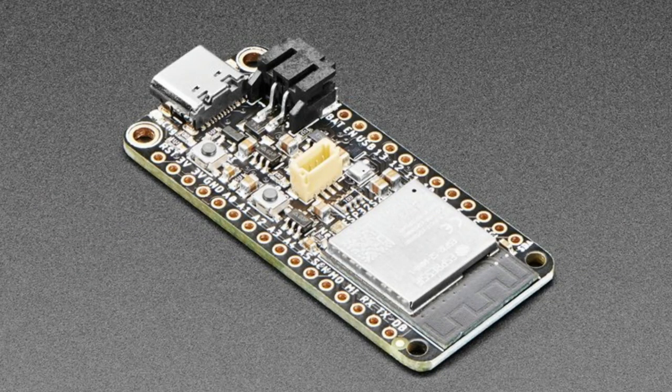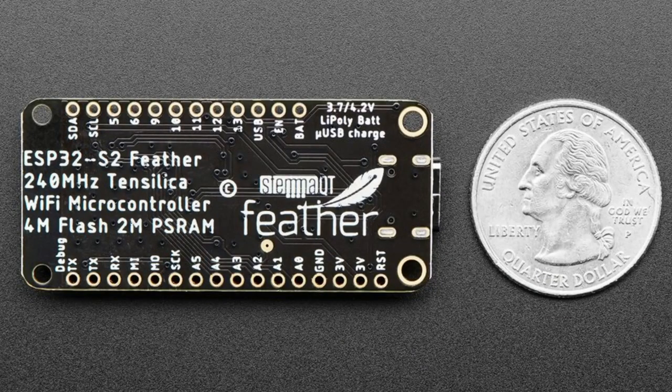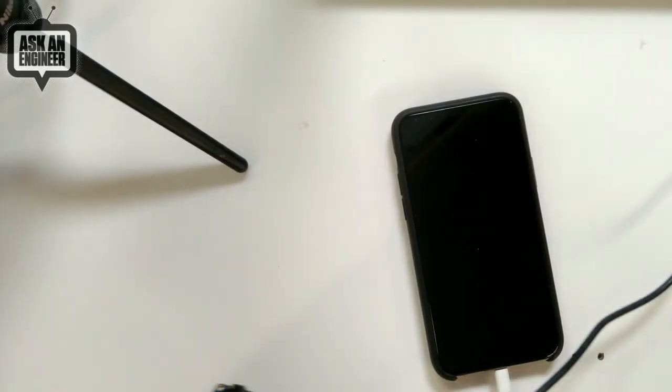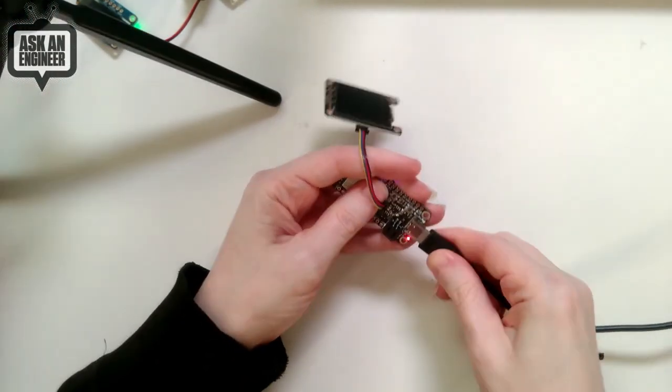And I've also learned a little bit more about low power stuff. So instead of a transistor to switch on and off the power to the QT port, I've actually just thrown on another LDO. So there's two low dropout regulators, one for the NeoPixel and I2C, one for the main board. And that means you can easily cut power to the NeoPixel and I2C. So even if you have stuff plugged into the QT port, you'll be able to get that 70 microamp low power draw in deep sleep. And we're also going to have the version without the BME280 released into the store soon, but we wanted to start with this version.